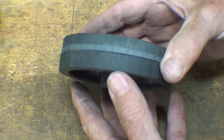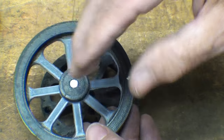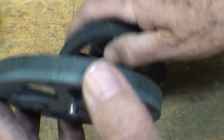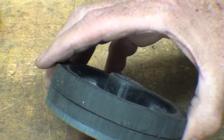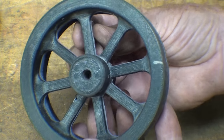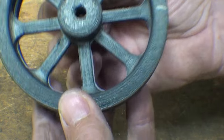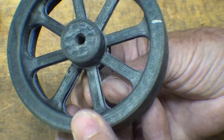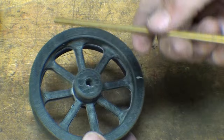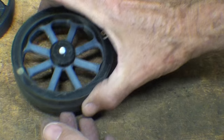I'm not sure what kind of plastic Herb used — I recognize the smell when sanding but don't know what it is. Apparently he used two different kinds of plastic, and I think it starts with some kind of thread that he has to buy — it's rather expensive too. I had a change of heart: I took both of these on the belt sander and sanded two degrees of pattern draft on them. Now I'm ready to put the other alignment pin in, but there's a little problem with indexing — if I line up one spoke perfectly, the spokes on the opposite side aren't quite lined up.